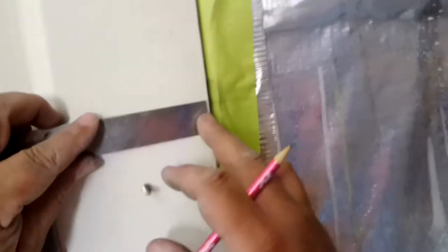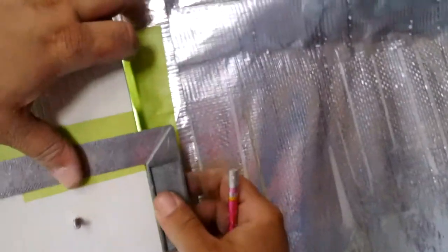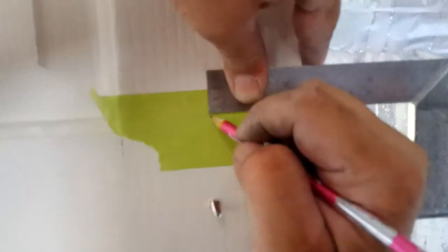I'm going to bring that line across because that's my most important mark right now. Let's just check the door — the door is actually rubbing at the top here but that can be adjusted later on. We have our line here so it's important we carry this on. It could use a bit more masking tape so I don't have marks on the door. The idea is to line this lock up to where our striker plate is. Now, off the instructions we have a 60mm backset, so we go from 60 to find our centre.